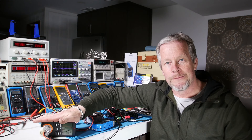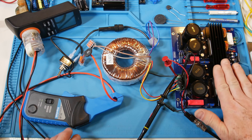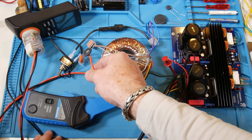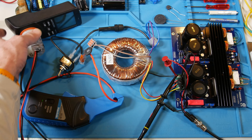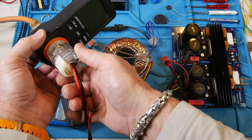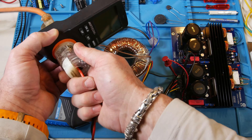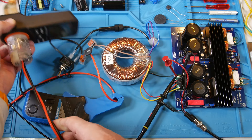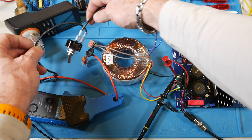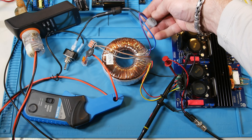This is the complete setup for the power supply where I'll be testing the amplifier in the next videos. We have our transformer and our thermistor. Power comes in from the wall here, goes to this power meter, then to this power cable I made — red and black wire. Black is the line, comes up and goes through the switch we use to turn it on and off to catch inrush currents, and here's a fuse just for protection — always a good idea.